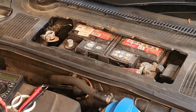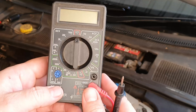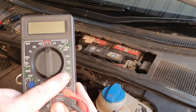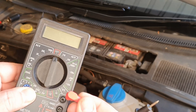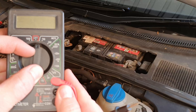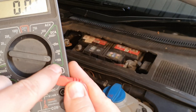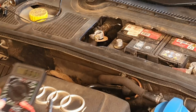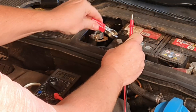The next thing I'm going to do is attach my multimeter to those terminals. On the multimeter there is a 10-amp measurement option, which is what we're going to use. On my specific multimeter, the 10-amp option has a different portal for one lead which has to be moved over there, as indicated on the multimeter itself. Once that is done, I'm going to move it to the 10-amp option — let's zoom in — you can see it says 10A, so we're going to put it over there.